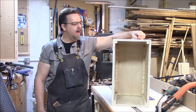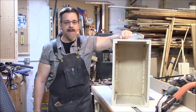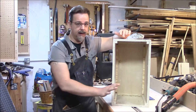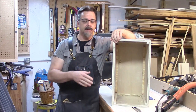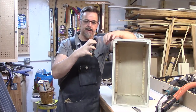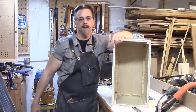It's pretty much close to being done. I've gone over with 120-grit sandpaper — I didn't go any coarser because the plywood was already pretty smooth and the top veneer is thin, so I want to minimize the risk of sanding through. I want to think about finishing. If you've seen my previous videos, you know I'm really into shellac, especially for shop furniture — it's very cheap, easy to work with, and if something gets screwed up, you can just put on another coat and they melt together because it's alcohol-based.